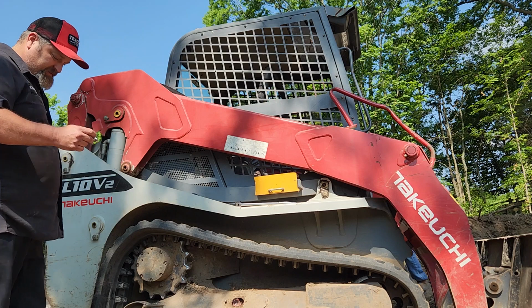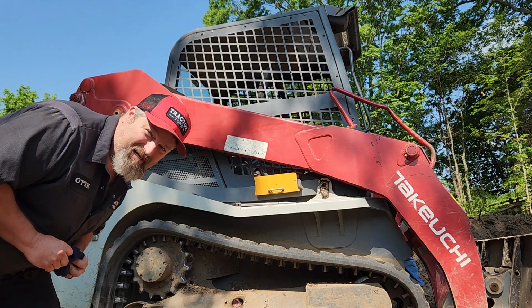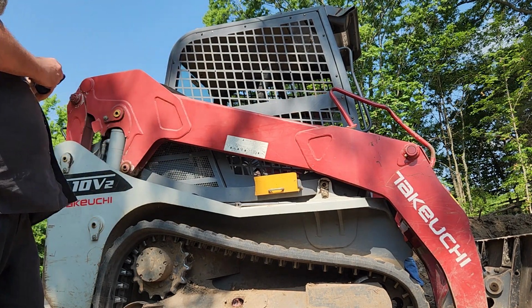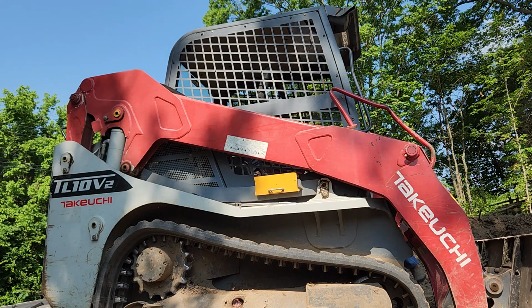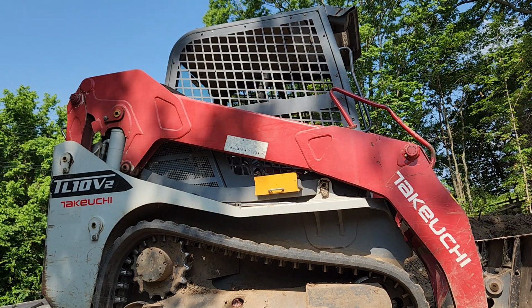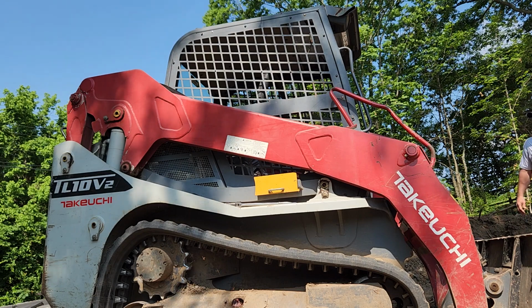So what he's talking about is inside here. What you see that hole in is pushing this idler, because this is what it is right here. Push it up. I don't even have to look at this. You don't have to have it jacked up. But you look at the tension with a track. Is that about what it should be? Yes, that's what it should be on this side. Because Audie and myself, we made sure. Whenever you get them, they'll just have a firm wiggle. Yep. That's what you want.